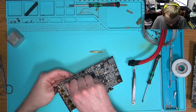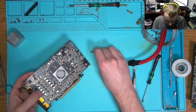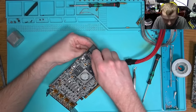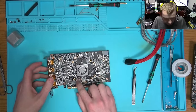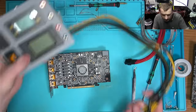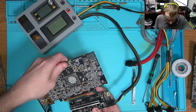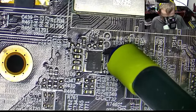What I'm doing right now is putting that 1.8 volt back on the working card so that I can see how the BIOS behaves, as well as how the oscillator or frequency generator works when it's working properly. Let's check — do we check this pin or do we check these pins here?